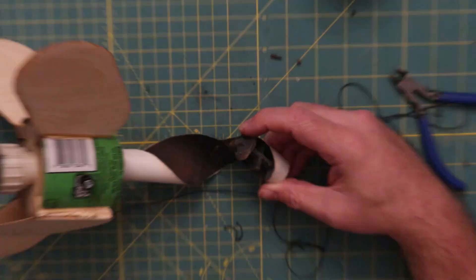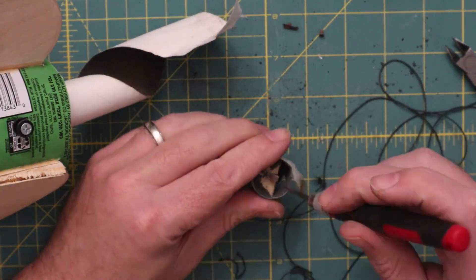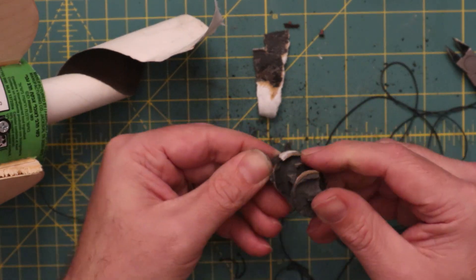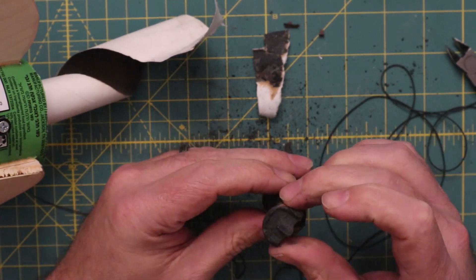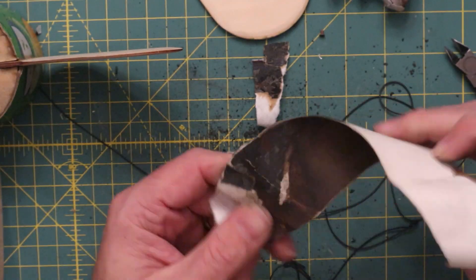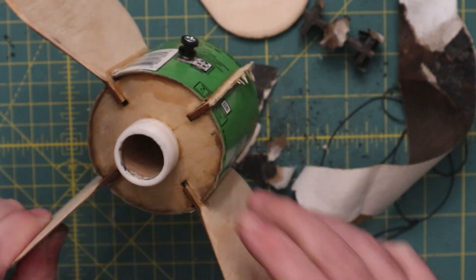The end of the motor mount had a three half-moon baffle put in with JB Weld to hold it in place and provide some heat tolerance, and it held up pretty well. We can see there's a decent amount of burn debris, but the real problem is that we've charred and made brittle the whole engine tube. We've done some other baffles where we sprayed high-temperature spray paint inside — that seems to help a little — but overall, these thin-wall low-power tubes, for minimum diameter at least, are just not suitable for this style of baffle as convenient as they are otherwise.